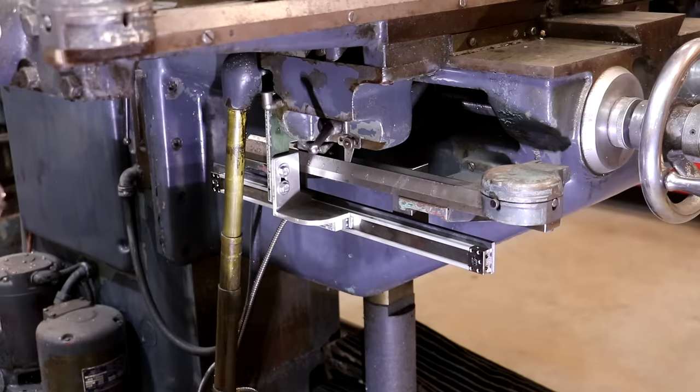Let me zoom in and show you some of the functions, because it's pretty cool. On this EL750 model, we have an LCD screen — liquid crystal display — and all the buttons are touch screen. Let's say I want to re-zero everything. Pretty easy to do — just go in here, hit the zero, select the axis, hit enter, and we're all zeroed out. Just like any DRO, it keeps track of your coordinates from wherever you zero off of. You can switch quickly between inch mode and millimeter mode. Right now I'm in inch mode, but if you flip to millimeter it reads in millimeters. I'll mostly be running in inch mode.